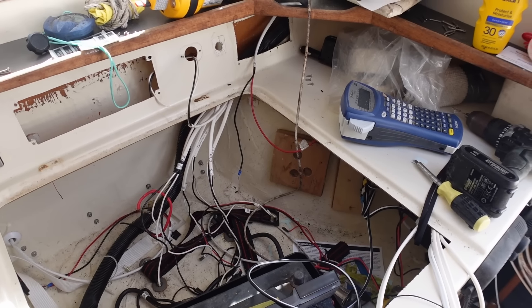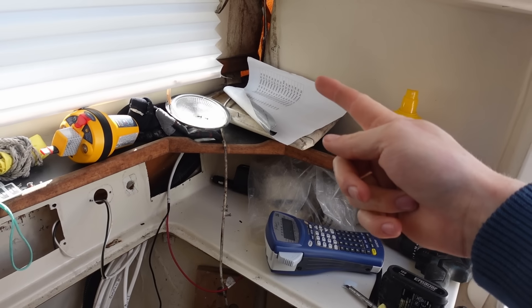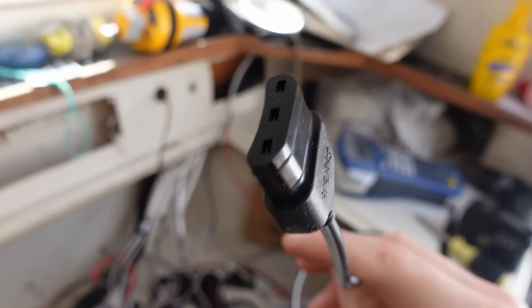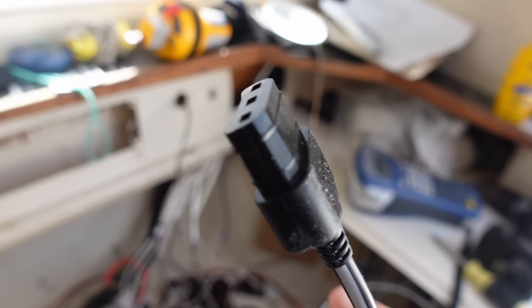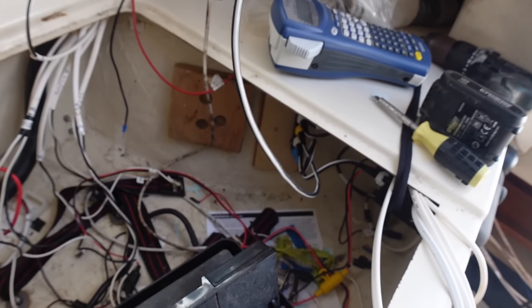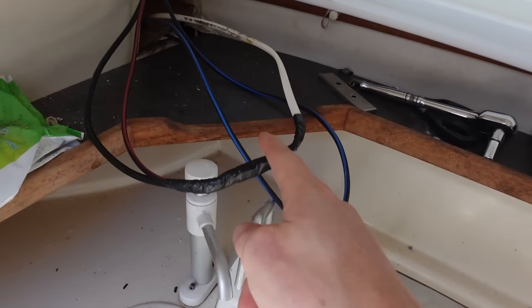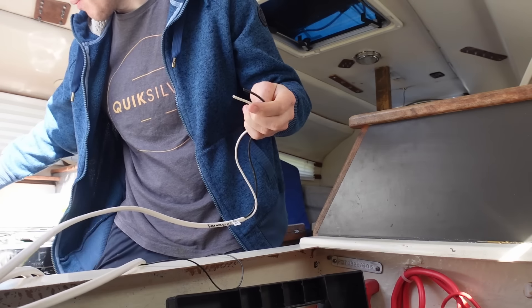Now that everything on the other side of the boat is done, you've only really got to focus here and at the mast. What I need to do is run the data cable from the tiller pilot plug — just up that little hole there — and run it out to connect into this wire here. I can either crimp on a connector to the end or strip it down and crimp it on, which might be better because I can waterproof it properly. It'd also be good to shorten up this wire. The other thing is connecting the power for the radio.